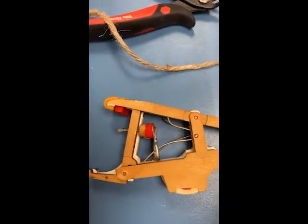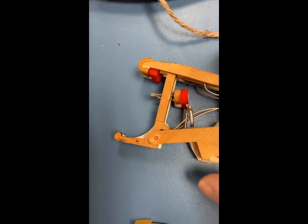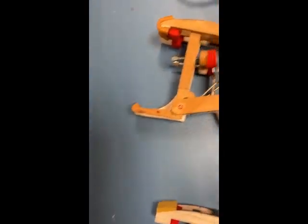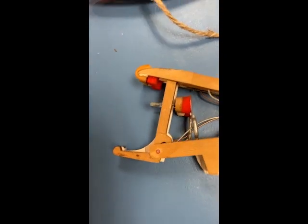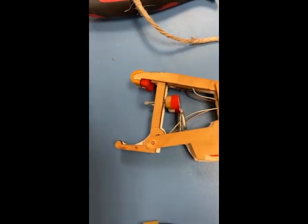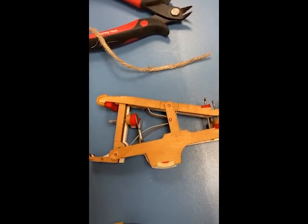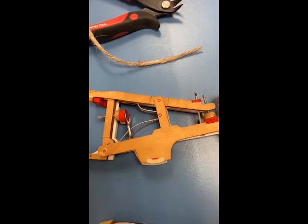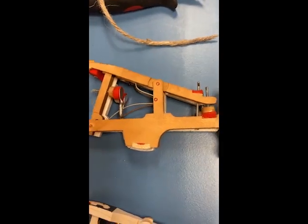The repetition lever balancer is the right length and in the right position, the post is in the right place, and the jack tip and tender are in the right place. In fact, when regulated, the jack tip in the new parts comes out right on the scribe line for pre-setup.